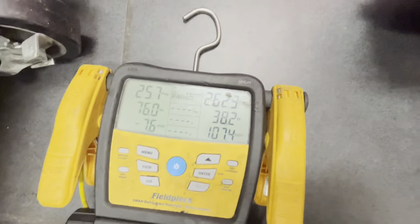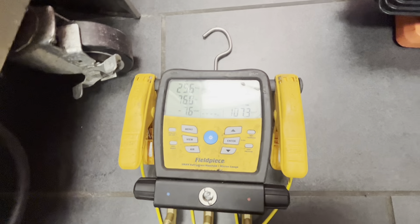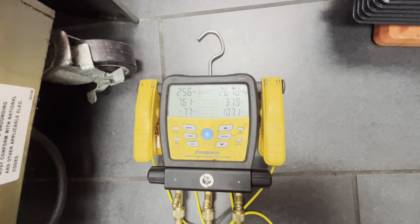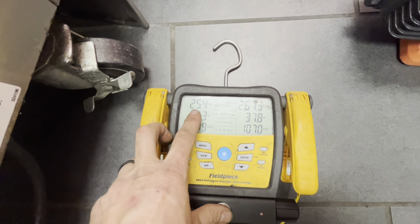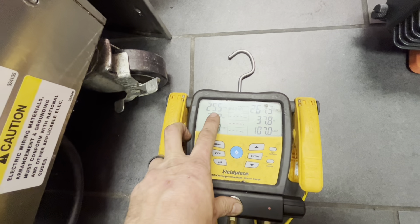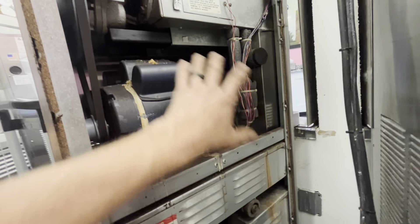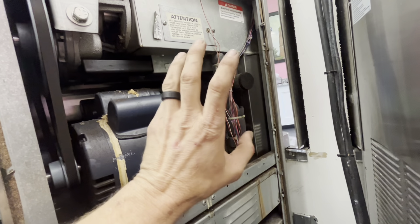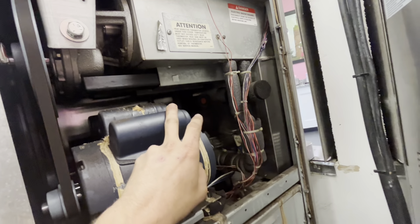These have AXVs. What you do is run one barrel at a time and dial it to 21.5. When we stop and only one barrel runs, it's 21.5 — dead on. So each side is running 21.5 individually. Now when we run both at once — which was the test — they were both at about 30 degrees before. We fired them individually, set them for 21.5, then fired both at once. Now I'm running 25.5, but that's fine because it pulled down really fast. We've re-secured all our wires. Winner on this one.